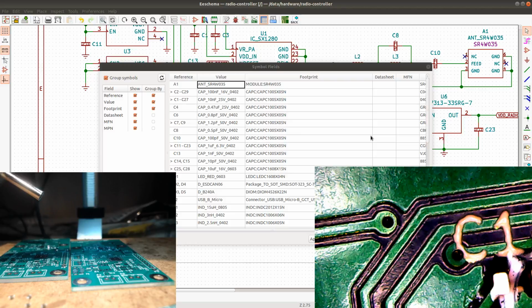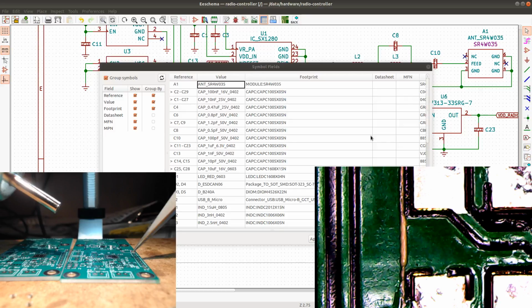Yeah. Let's just let me show the flux. Just got a little messy. Yeah, that's better. Great. Without enough flux, solder doesn't flow. Let's see. So C28 and which one was it? C25, I guess. Or is it C25 and C28? Yeah, C25, C28. Great. So let's put this in there. Gonna make a little bit better prep for that set of pads. Yeah, cool.